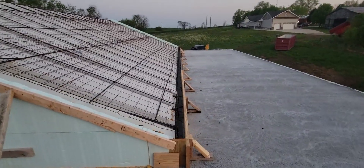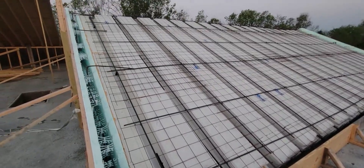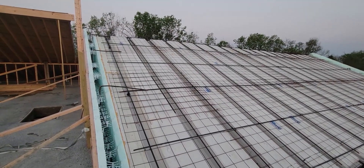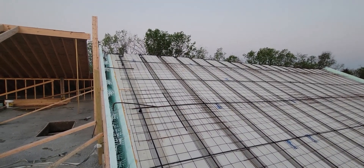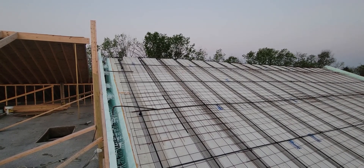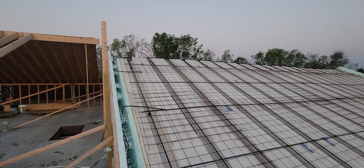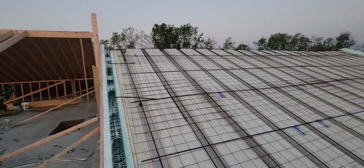And here's our edge for the concrete. We have all of our rebar in place. We looped the middle mesh over the top and tied it in on both sides so that as the concrete slumps it pulls that mesh tight on the top. It doesn't slide — we've had problems in the past with that sliding.